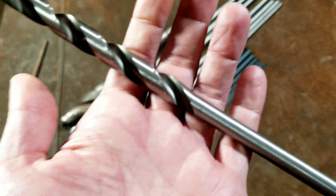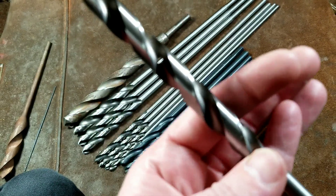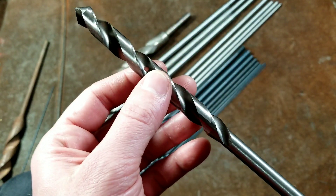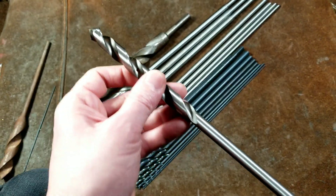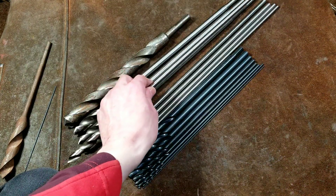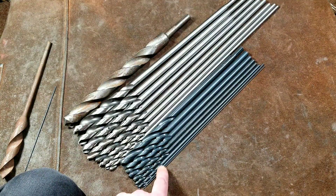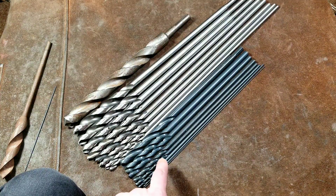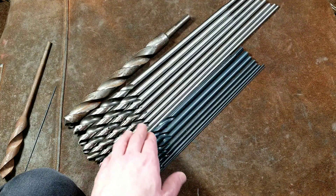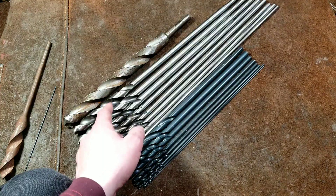Just for cable installation work, anything like that. These particular units are Irwin's — they are not particularly good, but they were pretty cheap. The other telltale sign of them is that they have a hole in them, so you can run the drill bit through and then attach a fish tape or fishing wire to the drill bit itself, then pull the drill bit back out and yank your cables through the hole — two birds with one stone with these bits. They also tend to come from larger sizes: this aircraft drill set is an 8-piece set going from 1/16-inch through 1/2-inch. This is an 8-piece set of installation drills, but since you rarely need tiny little holes, it goes from 1/4-inch up to 3/4-inch.